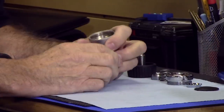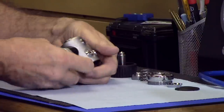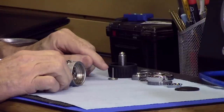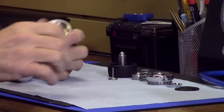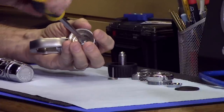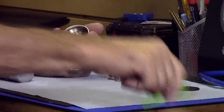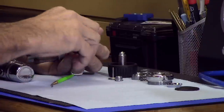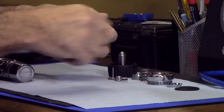This is a diaphragm regulator, so we have to have a diaphragm — there it is. Underneath the diaphragm is the plunger, sometimes called a flat washer. In the middle of the plunger is a pin — in this particular case it's a separate piece. Underneath that is the seat carrier — let's take that out. Keep in mind that I've loosened all this in advance; this is not how easily a regulator normally comes apart. There's the seat carrier and the seat itself with an o-ring.